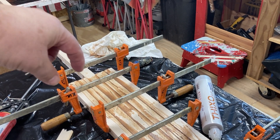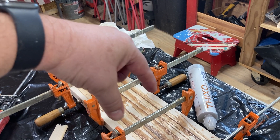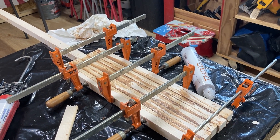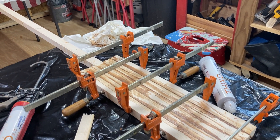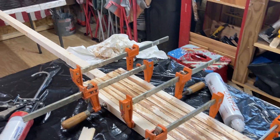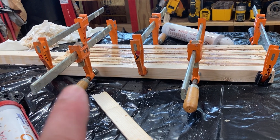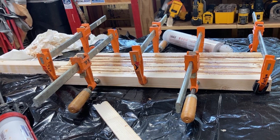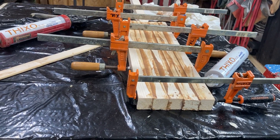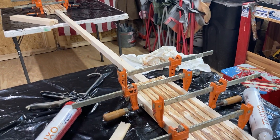The shape on this blade is going to start at the top, widen out to six inches at its widest, then taper down a little bit, still with a sizable tip in case you need to push off against a dock or the bottom. The blade is 20 inches long and six inches at the widest. On the side we're going to put a little bit of concave into it. He also likes to put a diamond shape on the bottom and a little bit of concave on the top.